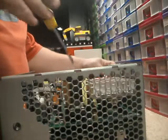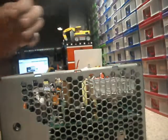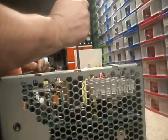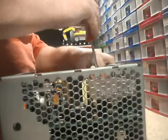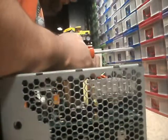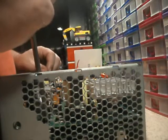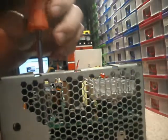Actually, one thing I will do now while I remember is pull the two Molex connectors off the board and the ATX connector. I'm going to need a different Phillips to this one. Let's get these wires removed. Watch out because they both connect to the heatsink, so it's like there's a complete circuit there. I'm not a hundred percent certain what these bunches of wires do. Take those out — so that's our wires disconnected from this board and out of the way.